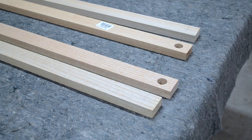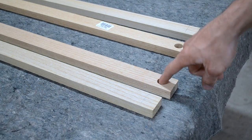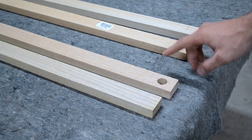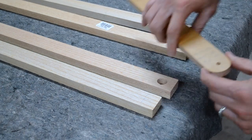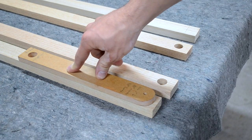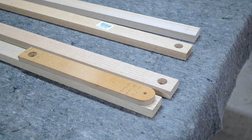On the two center pieces for the left and right side — your cross supports — I cut a hole one inch down for the three-quarter inch rod to go in on both sides. I marked one inch down and three-quarters of an inch in, then drilled the hole. I'm going to use the template with double-sided tape to hold it down, then use a flush router bit to router off the rounded edge. You need this rounded edge so that the legs will be able to fold up without binding against the top surface of the tray.